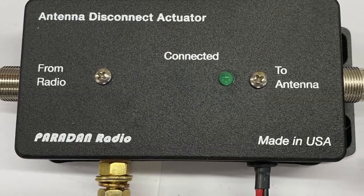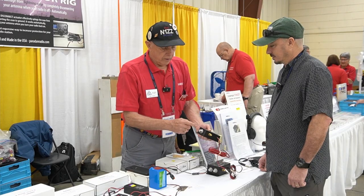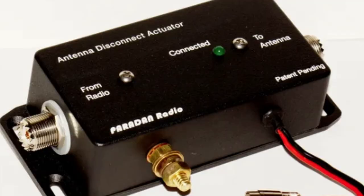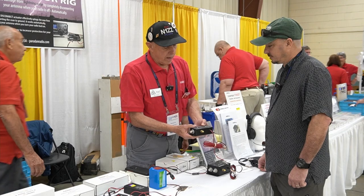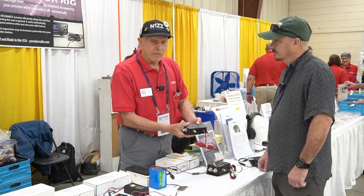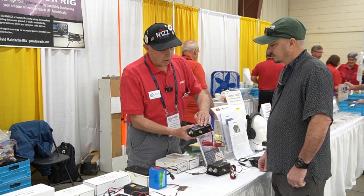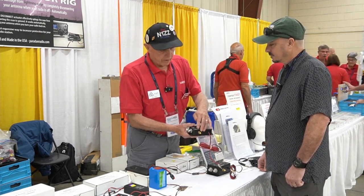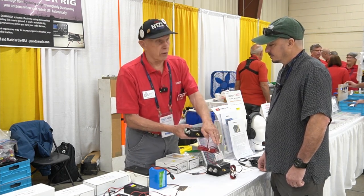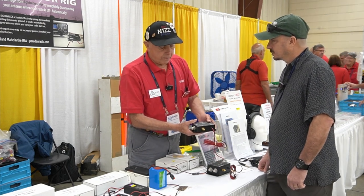Your coax from your antenna goes here. The coax here goes to your radio. You'll notice this coax is isolated for a reason. Right now this is not powered — it's in a relaxed mode. The relaxed mode is a safe mode. Right now, what is connected to the antenna side goes to the ground terminal. This ground terminal should go to earth — it should not go to the back of your radio, but right to earth.